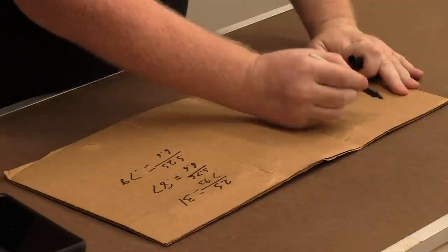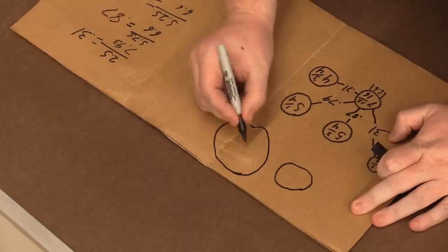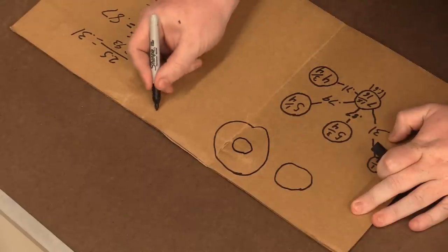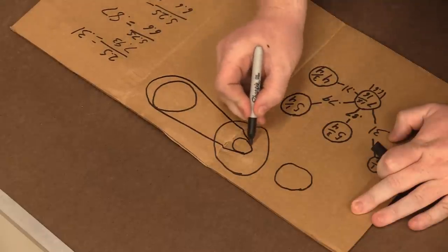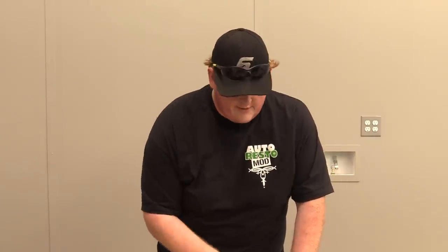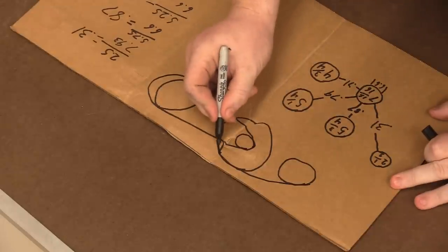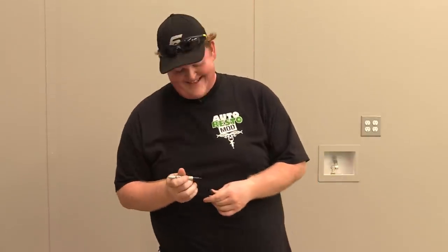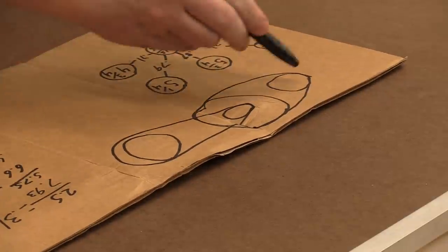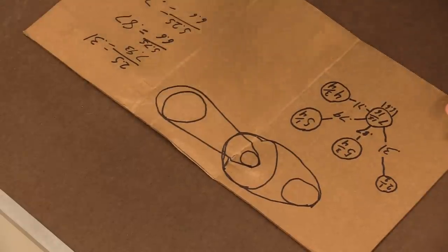Now there is also a compound pulley — that's a small pulley driving a really big pulley that has a smaller pulley in it, which then drives another small pulley with belts running through the system. That is a compound belt drive. A small pulley driving a bigger pulley, which has a smaller pulley in it driving another pulley — this just gives you gear reduction in the system. If you're having to calculate compound systems, use an online calculator — it's way simpler.